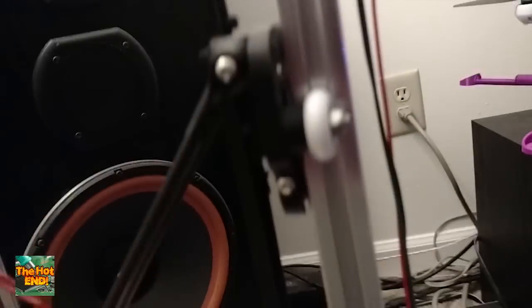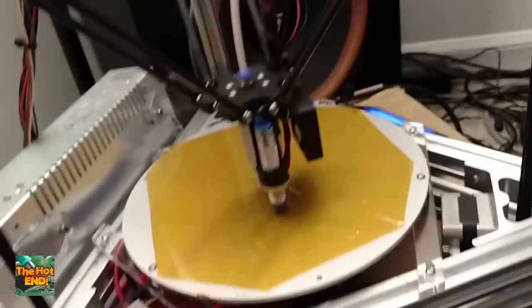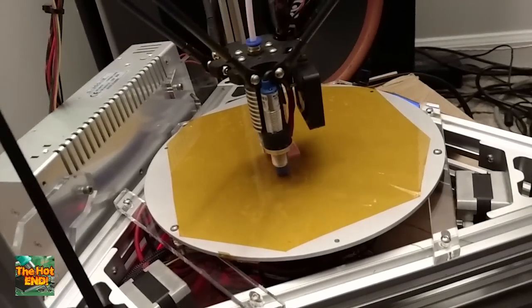On the carriages here on the back, I had to make an adjustment and get a different set of screws. Lowe's didn't carry the right kind, so what I did was I took a Dremel and shaved the end of the screw off and shaved the nylock metal off, so it gives smooth travel on all three of these little carriages. That's really kind of a must — smooth motion means smooth printing.